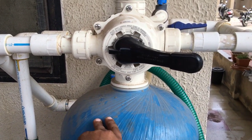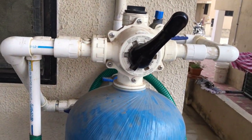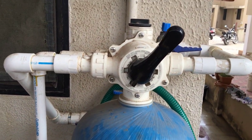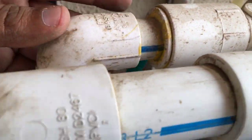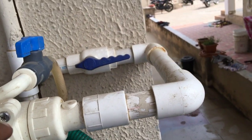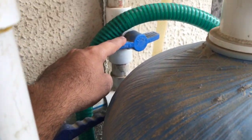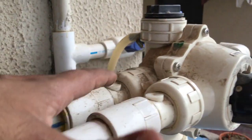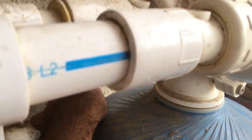Now stop the water and put the valve back in service. The softener is now ready — it has been regenerated and is again ready for filtering your water. You can also see the bypass valves here: in case this water softener does not function well, you can bypass through these valves. The center valve will be open and the softener will be bypassed. That is the bypass feature I have installed at my wall — this system takes water towards your overhead tank.